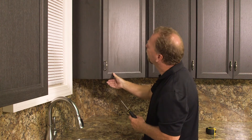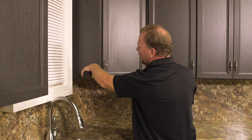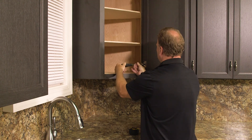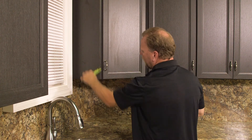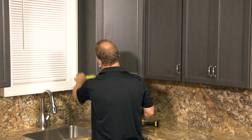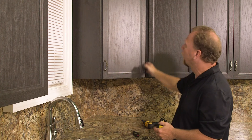The other screw in the front is to adjust the door going left and right. Look at your reveal — you can see you have a larger reveal at the top than at the bottom. At the top we have three-quarters of an inch; at the bottom we're showing five-eighths of an inch. So run that front screw out to bring the door over until it's where you need it to be. Now your door is tight on the top and the bottom, even across the bottom, your reveal is even, and it's in line with the other doors beside it.